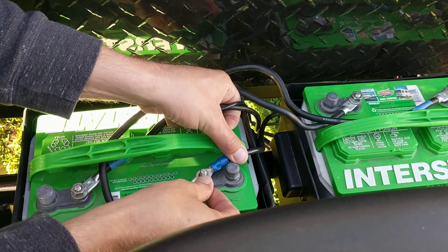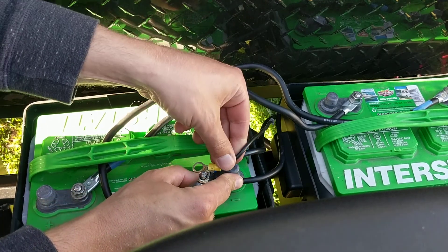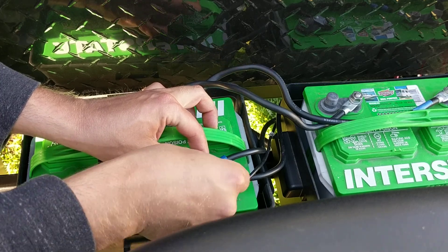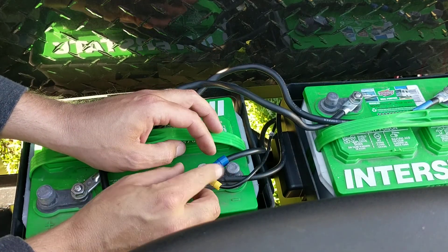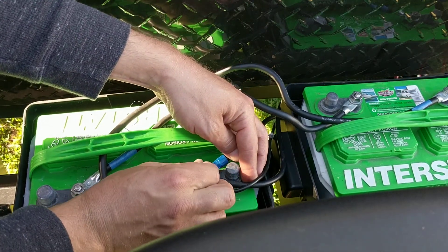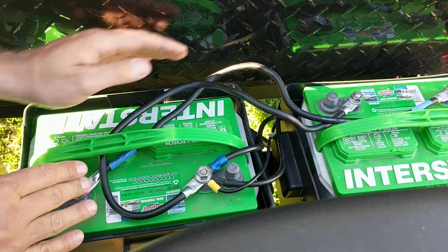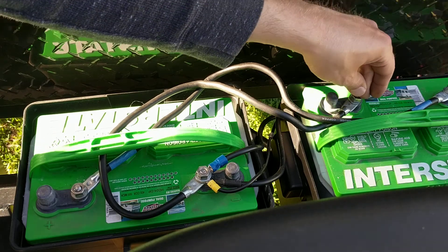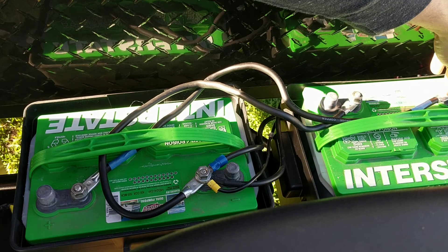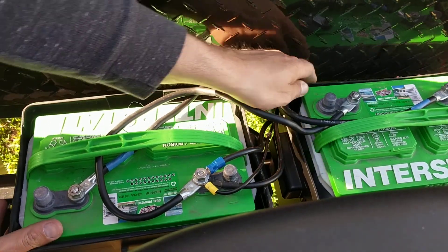I'm going to put this up right here. This is probably useless — I'll probably take that out in the future once I unhook the wire there, because I got my own solar wire that I did, and I'll show you guys in another video how I did that. So you got negative from here, your positive runs to this positive, and these two negatives are connected. Now I'm going to connect my positive stuff on this battery and I got my loop of two batteries — two 12 volts — running this.